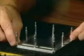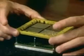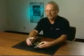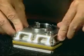Adding all those up, it requires approximately 350 pounds of force to fully engage the multi-chip module down to the printed circuit board. To demonstrate how this gets assembled into the module: we have a backer plate that goes on the back of the PC board. Because of the 350 pounds of force, we don't want to push the MCM through the PC card. The compliant interconnect is then mounted permanently to the PC board, and the MCM comes pre-packaged and sealed from the vendor and gets put onto the compliant interconnect.